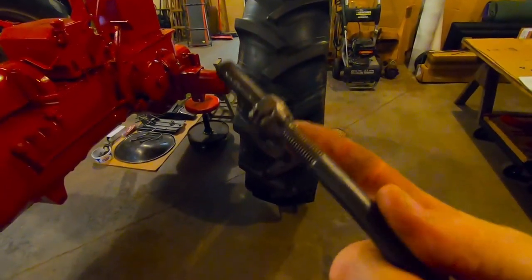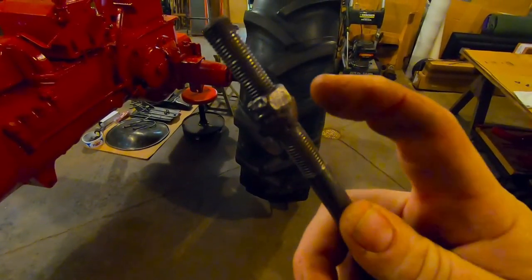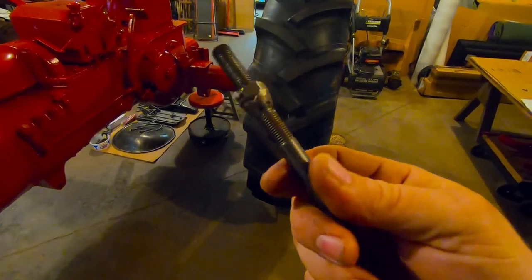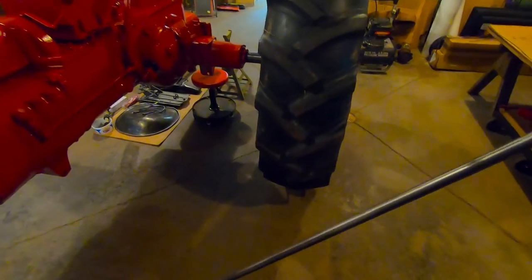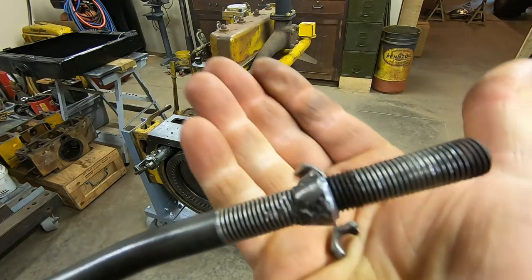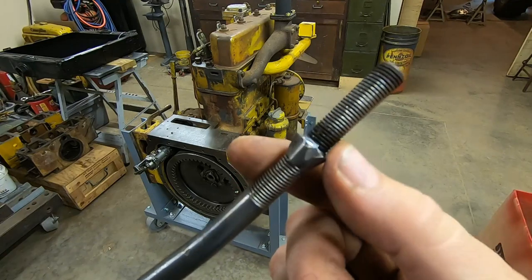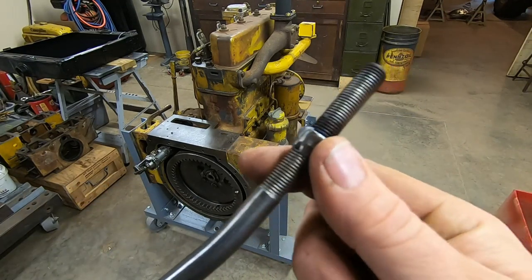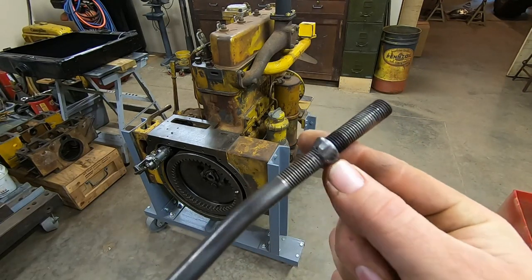I'm going to score around the bottom of the nut — not so deep that I get into the rod, but just enough to break that weld. Then I'll carefully score down each side of the nut, 180 degrees apart, and see if I can crack it off. We'll see if they were repairing a broken shaft or just decided to make sure it never moved again. Good news — I was successful at splitting that nut off, and I don't believe I damaged any threads in the process. Now I just need to get the rest of that weld off. So far no indicators of a repair to the threaded portion. I'll take the rest of this weld down and see what I can see. If it doesn't look like this has been broken, I might just try re-threading and see how well those threads clean up.